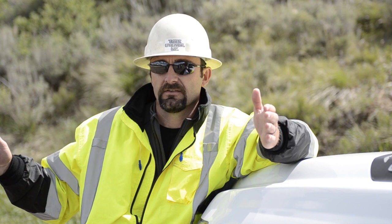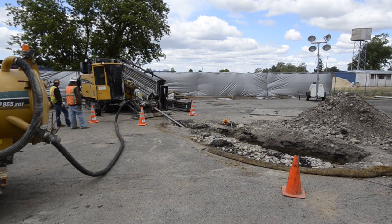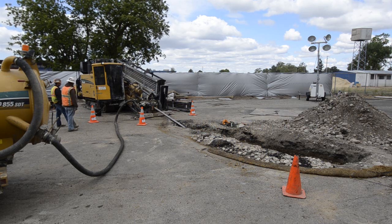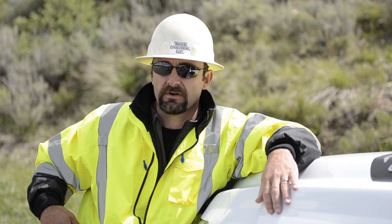The deepest spot in the middle of the Boise River — because of the distances we had to get in the ground and come out of the ground — were not very far from the banks of the river. We couldn't be way out, so our profile, we knew we had to be deep in order to get that arc. We were actually about 50 feet deep under the middle of the river.